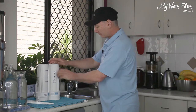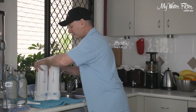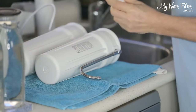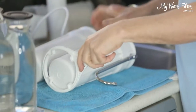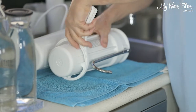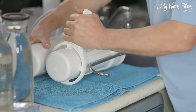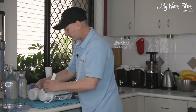Water's turned off and water's stopped flowing out of it, so what we're going to do is just lay it over on its side to start. We've got the housing tool — it's got 'close' and 'open' on it and they go down over the top of the housing. It's just normal Australian thread, so we're going to turn it to the right to make it go tight. Today we're going to undo it, so we're going to turn it anti-clockwise, looking down on the top of the system.